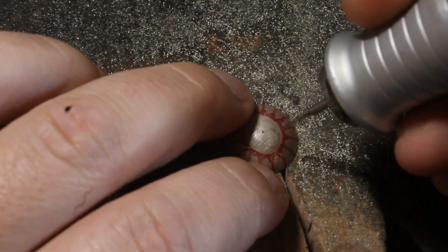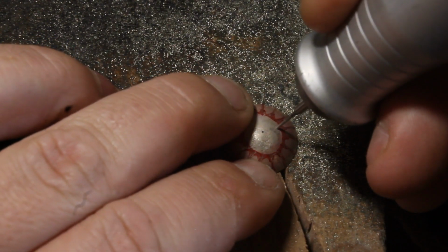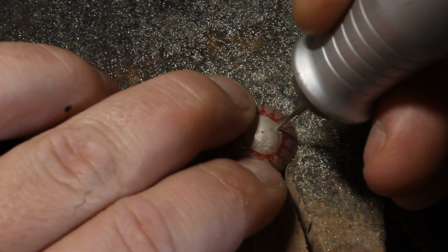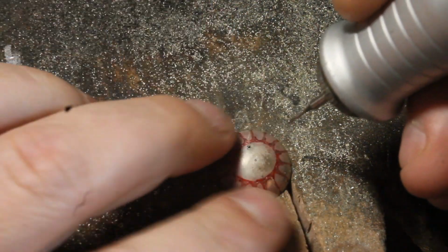Before I can cut out the middle part, I have to drill a couple of pilot holes. I drilled three, even though the piece was small enough that I only really needed one, but that way, in case I broke a blade, I had a starting point that might have been close to where the blade broke.